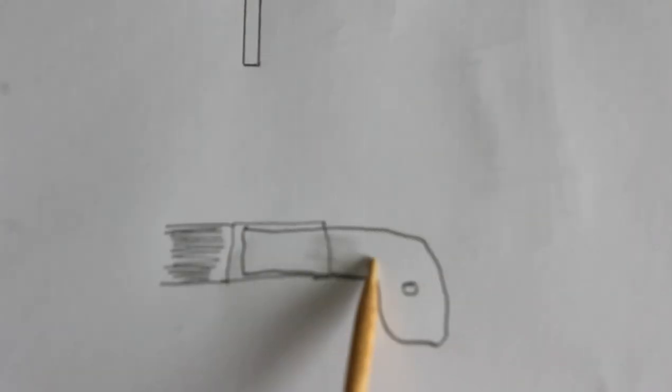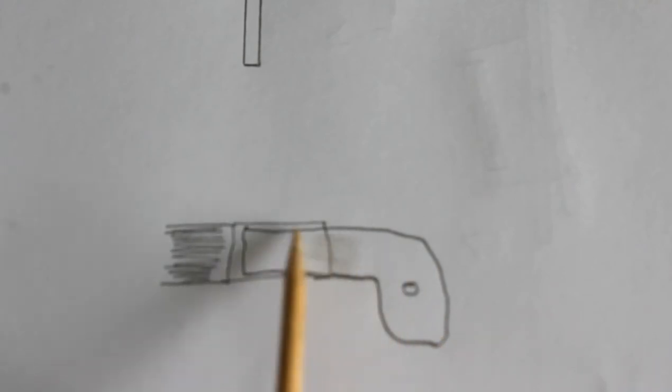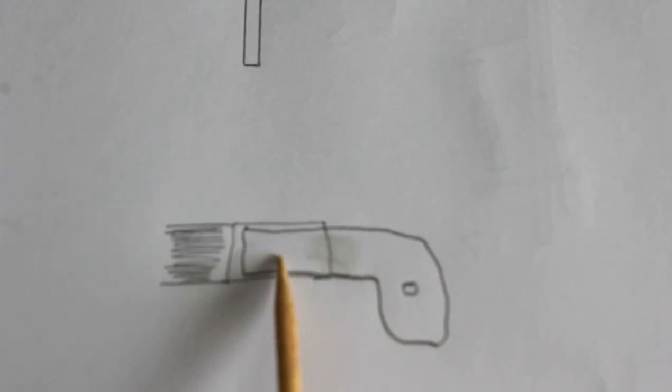The next thing is I fabricated this piece of trace here to complete the circuit, and I cut it to the appropriate shape. It's a sort of sock shape or L shape in the diagram. I cleaned the underside of it, particularly this area where it was going to make contact with the existing trace, and then fluxed it all again on both sides and heated this up and pushed it down into the solder that was underneath it to get the joint, and that worked just fine.